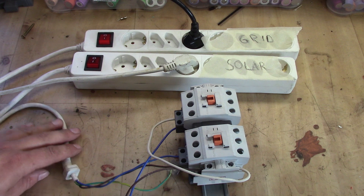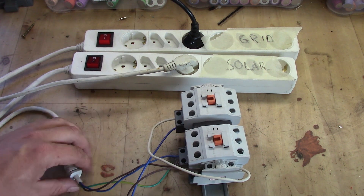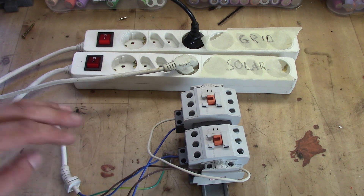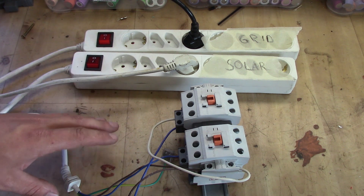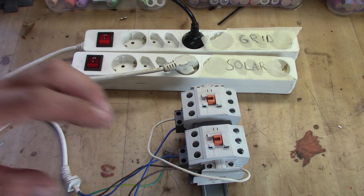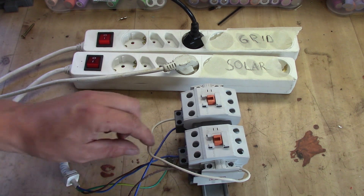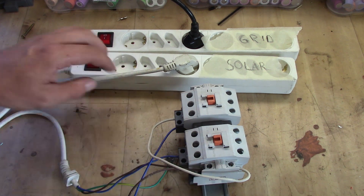This is pretty simple because solar is always connected to the contactor — there is no electrical disconnection or electrical brake on the solar. No matter what, the solar will try to put this contactor on. This is both good and bad, because if this contactor hangs, this one will try to start anyway, no matter if the other one is on or not. On the other hand, when this one shuts off, the power goes directly through the contactor relay and starts the other one.